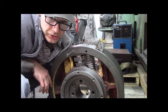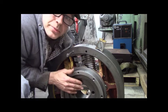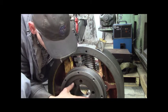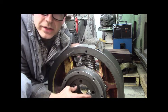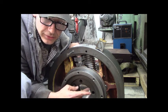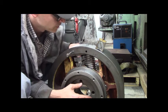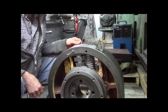So this is the beginning. I showed you in another video I soldered the score that was in the offset head. I just wanted to catch you guys up on what I've been working on with this Summit Boring Head - I think Summit was Polish or Czech made. I need a piece of steel in here to make an adapter - I think seven inches is what I need, and an inch and a half thick. It's going to bolt to these four bolts and I think there's two dowel pins. I might buy a nine inch piece of steel from eBay round drops for like forty to fifty bucks, and that's going to allow me to put this on the Giddings and Lewis.